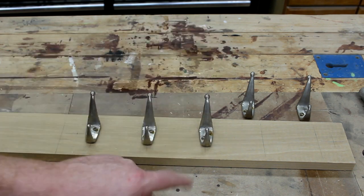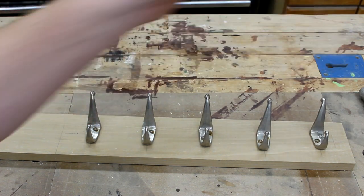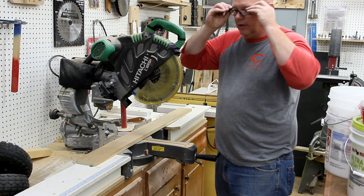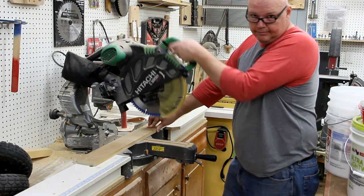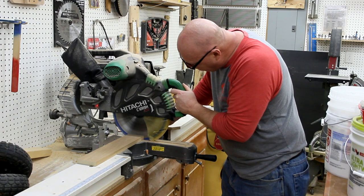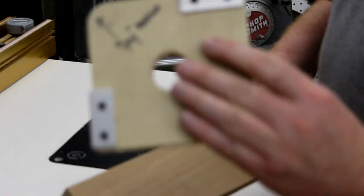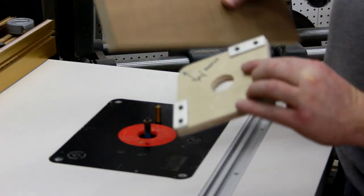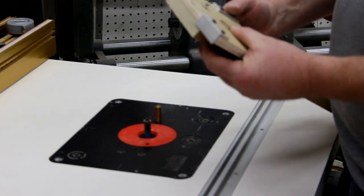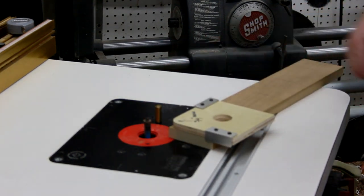All I have to do is measure top and bottom if I want them centered, or lower or higher — whatever I want. Our rack is ready. Now all I'm going to do is make a cut here. One of the pluses of this saw is it's got a laser, so it makes it easy to position. Then I'm going to take and use this little radius jig I've got — it's a pretty nice little guy, just a couple of pieces. I'll hook it onto the board on each side, and that'll give me my three-quarter inch radius using a top bearing pattern bit.